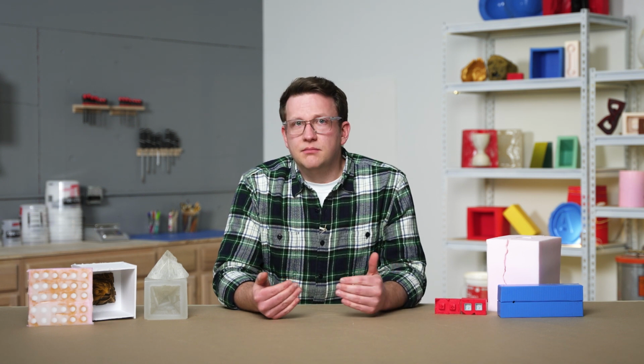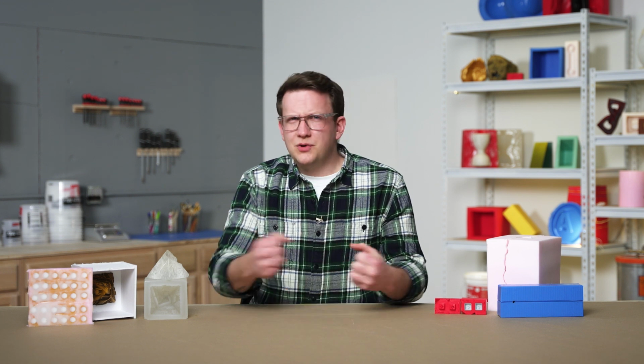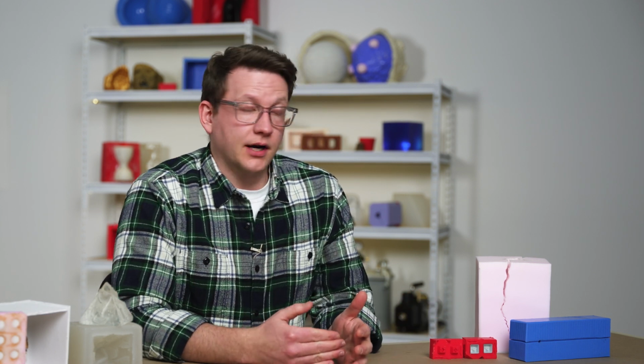In these situations, a few small relief cuts may be a better alternative to a ripped or damaged mold that won't work properly. We may also have planned to cut our mold from the beginning during our mold design phase. This is common to do when a master has some complexities, but not enough to warrant a two-part mold.